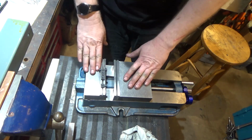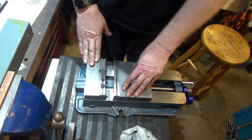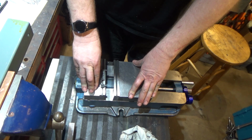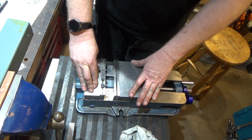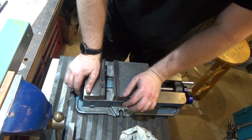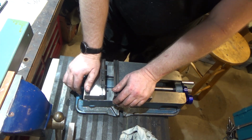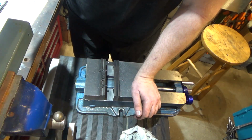So that concludes it. Generally a pretty easy operation. The hardest part is torquing the bolts that hold the fixed jaw down while you're loading it. I don't know if it'd be good for it or not. It may not be, everything's hardened, but it almost seems like an impact wrench would be the way to go. Either that or you're going to have to fix this to something, because it was really tough to do while it was floating, because it wanted to move because they were pushing so hard. So anyways, that's it, and hope it was useful, and hope to see you next time.